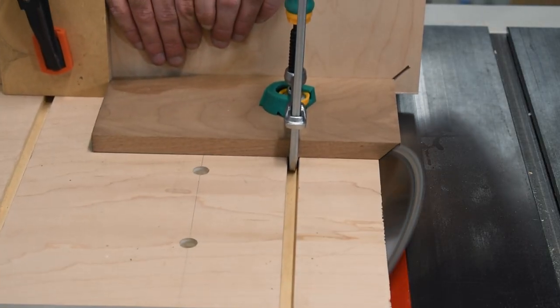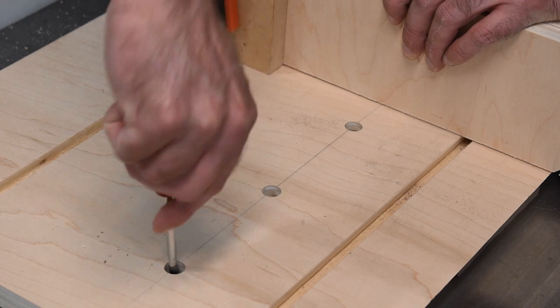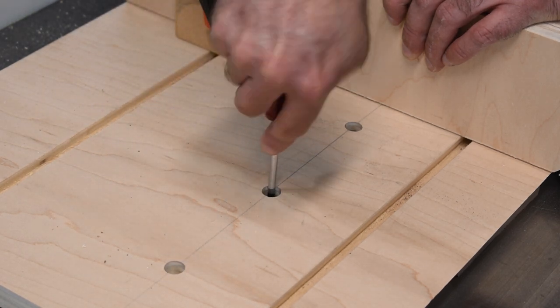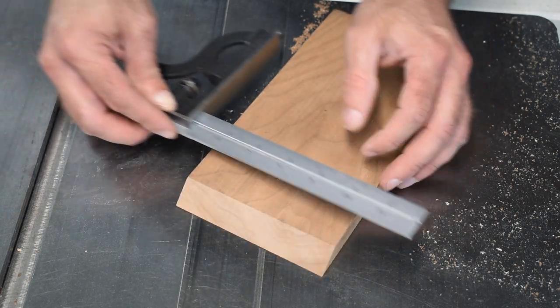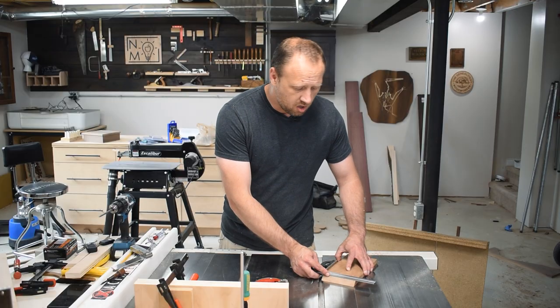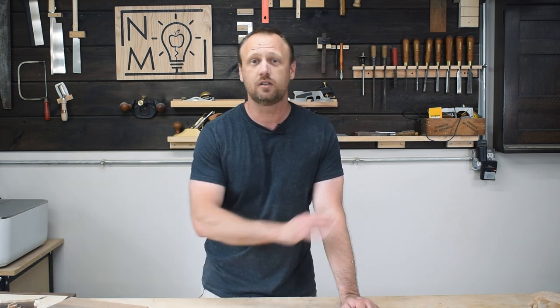The practice cut showed I was slightly off 90 degrees, so I loosened two of the three bolts holding the runner to the jig, shifted the jig slightly to the left, re-tightened, and did another practice cut. The results: this thing is dead on. I'm really excited to have this jig in the shop — it's going to help me crank out a lot of boxes. Hopefully this video inspires you to get in the shop and make some jigs. If you like this content, please subscribe — I put out videos every week. Get in your shop and build something awesome.